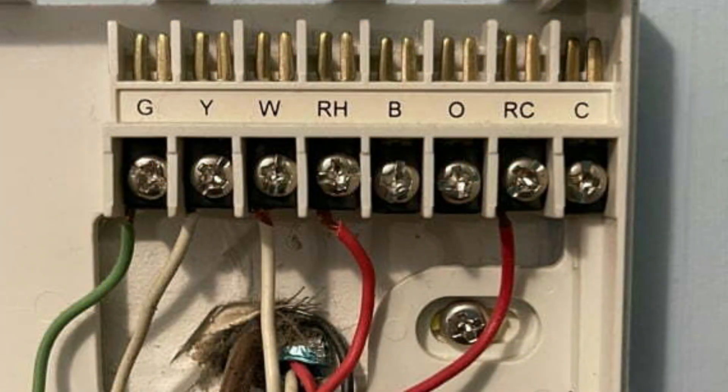As a quick side note, this doesn't work on steam — that's a different animal. And if you have a thermostat controlling two separate systems, this also won't work unless you're willing to separate those systems and run them each off their own thermostat. So if you have two red wires going to two separate R terminals — RC and RH — without a jumper in between, that's what you have. It is a personal choice.